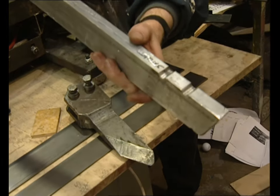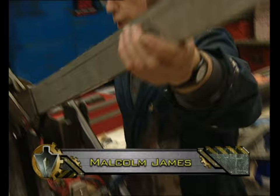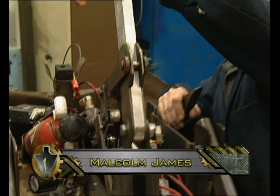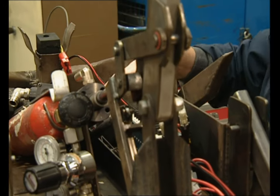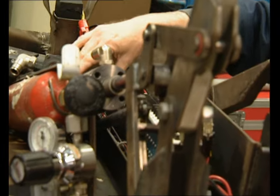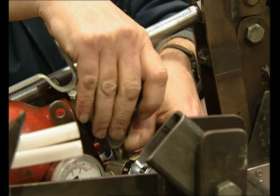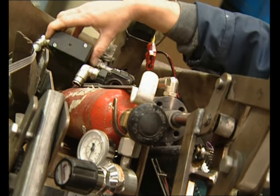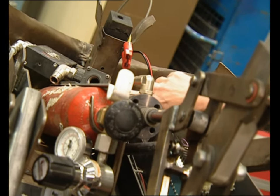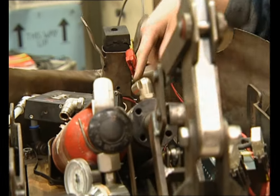Oh, look at that! The unique movement that Shunt has got on his axe is actually this. The full range of movement of the arm itself comes right back to here. But the actual force that is pushing it through that movement is this piston here. Basically, the supply of air or CO2, carbon dioxide, comes from this valve, this sort of regulator here, through a series of valves which control the opening and closing, and end up going in through this opening here, which actually pushes, like so, this ram out and keeps it going all the way down through there.